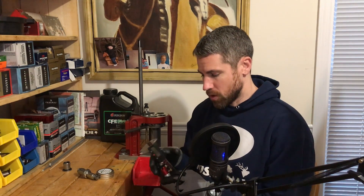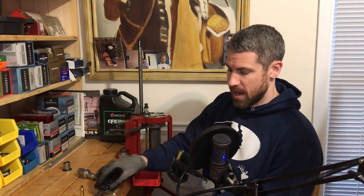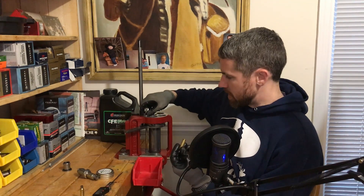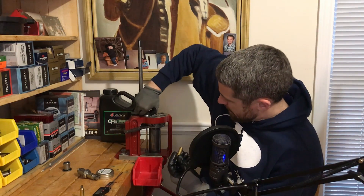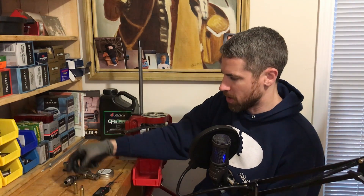What I'm going to do is take my calipers and the Hornady comparator tool — there are other brands out there, but I purchased the Hornady and it's worked really well for me. We're going to use it to compare the shoulder of my brass from a fired cartridge. This casing has been fired six times, been annealed, and now it's ready to be resized. One thing to be cognizant of is that if the brass still has the primer in it, you could be getting a reading off the primer versus the bottom of the case. So let's go ahead and deprime a couple pieces of brass first.